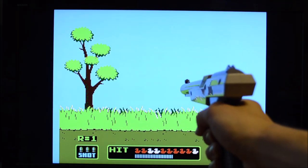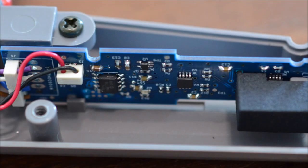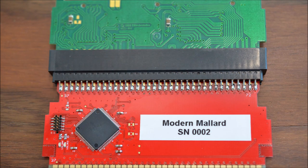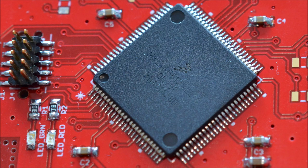In this video, I am using the so-called Modern Mallard, which consists of two parts. A new gun PCB which reacts to light signals from DC up to 7 kHz. The board was made in a way which allows it to distinguish between the light from the TV and the light of the sun or lamps inside the room. The second part is a PCB which is connected between the console and the original game cartridge. It patches the game ROM to accommodate for the lag which LCD TVs typically introduce. The board is so small that it can fit into NES cartridges together with the game PCB.